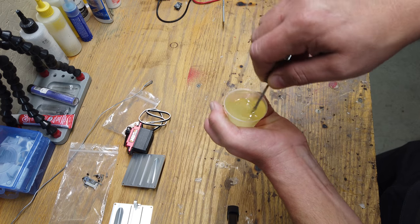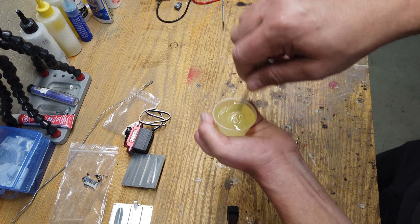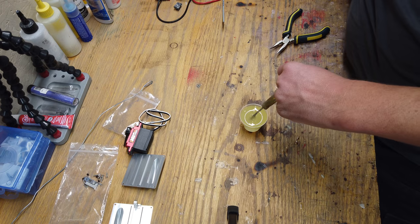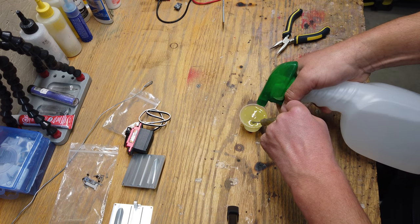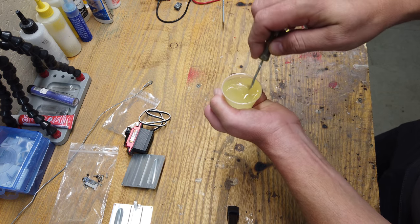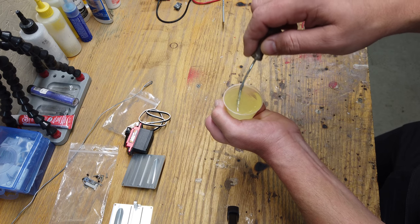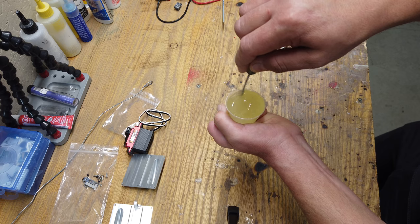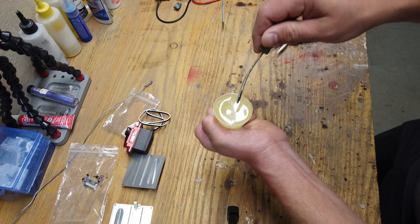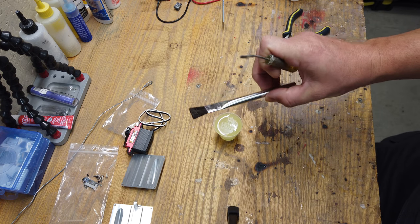I've mixed 15 milliliters with 15 milliliters, and we're using trusty bent screwdriver because this is a perfect job for it. Once that's nice and mixed, I'm going to add some rubbing alcohol to thin it out. I probably should have used less epoxy as our cup is very full, but I'm limited in the number of brushes I have. I like to get this fairly thin so the consistency is kind of like thick paint — and then brushing it on works very, very well.